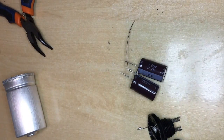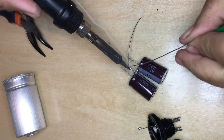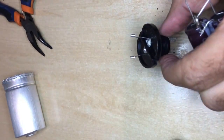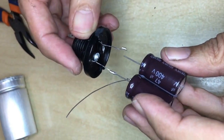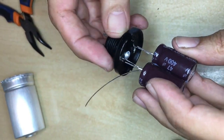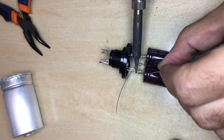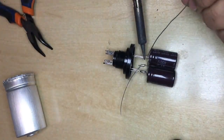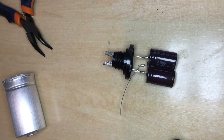If you use this technique to add extension wires, you end up with a very easy connection to solder. This was actually used originally in the old days to do repairs — it made it easier to solder components in place and resulted in a very clean solder joint, very solid and very easy to remove later if you decide to do so.